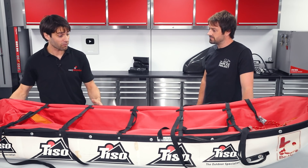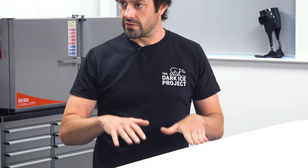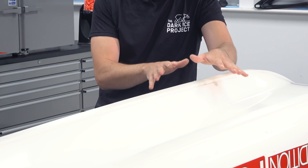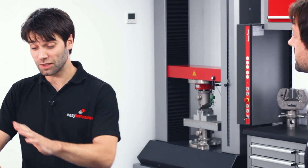Let's flip it over and have a look at the base, which is the primary molding. I can straight away see these runners — presumably they are polyethylene? Ultra-high molecular weight, yes — the same material you find on the base of a snowboard. What changes are we making to the design from this? Because we're looking at sea ice use, you want your weight set a little bit lower for stability since the sledge is more likely to be rocked around. I call these the feet — there's quite a big rise here and we're making that shallower. The sledge is also going to be slightly wider for the same stability. A nice smooth bottom of course, so if it catches the snow it's as low friction as possible.